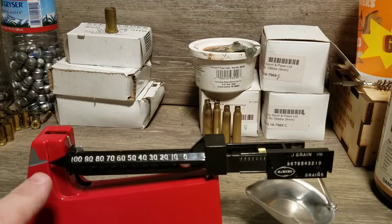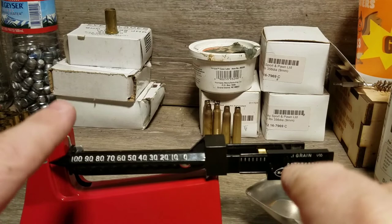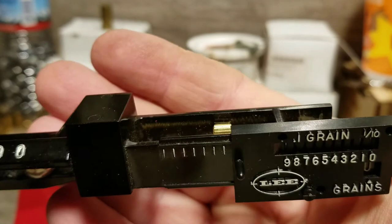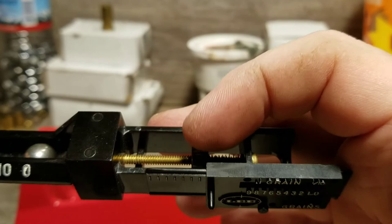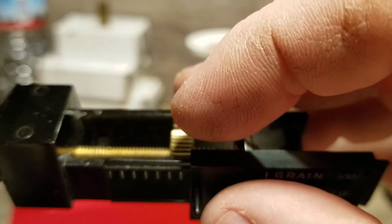The pointer for the beam is a little bit below the other pointer — it's close but a little on the low side. We need more weight on this end to balance it and get it to zero. Behind the beam is this screw with a spring to keep it tight so it doesn't turn by itself. All you have to do is turn this knob. Turning it toward me will move this piece of brass in that direction, shift more weight to the back, and lift the nose of the beam up. That's how we adjust that.